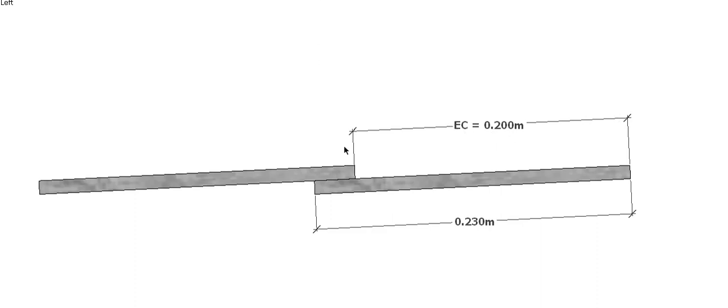So they're all good, because those ones we're deducting or taking a bit off the actual length of the board. But also think about decking. This decking board is 70mm, but when we put it in, we normally leave a gap, on average around 10mm. So this 70mm board actually has an effective cover of 80mm when we go to work it out. So that's effective cover. It's the actual distance that the board is covering on the wall, not necessarily the actual width of the board.